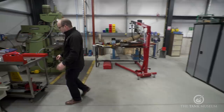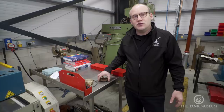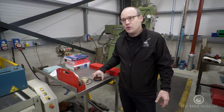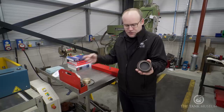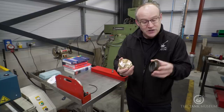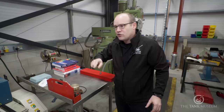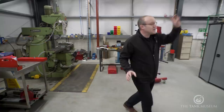Another project: as part of working towards building a spare Maybach engine, we're collaborating with University College London. They want to measure air movement on the breather pipe of our Maybach engine on Tiger 131 — how much air moves during operation and when it sits still, because with changing temperatures engines breathe in and out. The guys are machining a plug that fits on one of our spare Maybachs so we can attach a sensor to it. We didn't want to modify the original, so they made a new one to fit to Tiger 131.